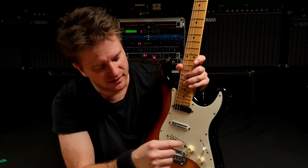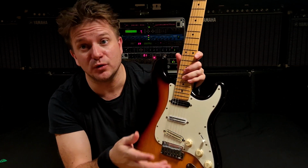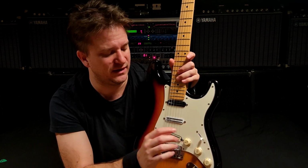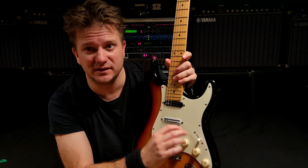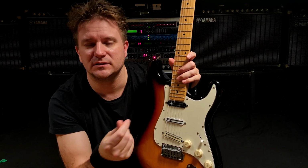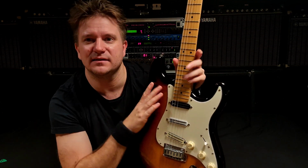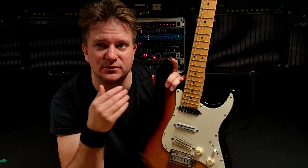So really nice. I have several guitars that I put passive treble bleed things in. It can work too, and it's nice not to have a battery inside here. But I must say, building a simple buffer in here with a battery is my all-time preferred way of doing it. It feels so good, and the sound seems much more powerful, or like it has more sustain, like there's more signal to work with, not just volume. It seems like it gets the best sound to my ears out of all the guitars when I do that.